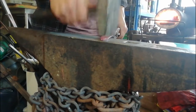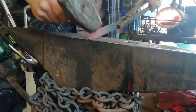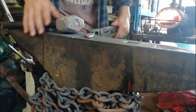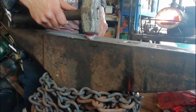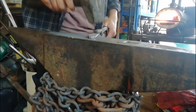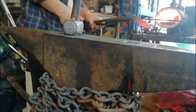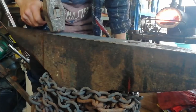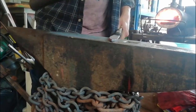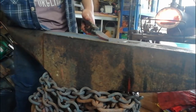What I'm attempting to do right now is use the edge of the hammer and just hit on the edge of the taper so that hopefully it pushes the middle part of the metal forward and eliminates that fold-over. We've just got the little fold-over in there so I'm going to quickly cool it off and then off-camera I'm going to grind that round off and re-taper it.